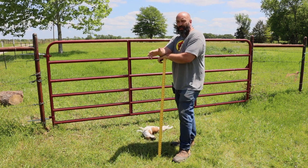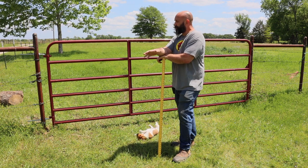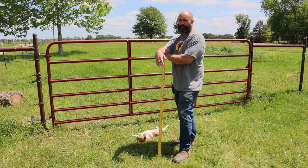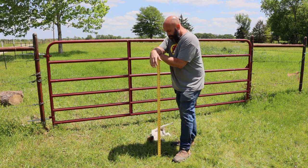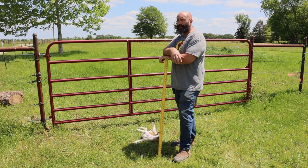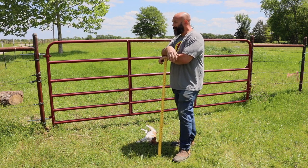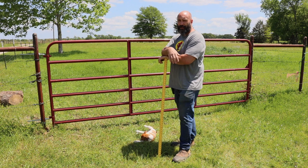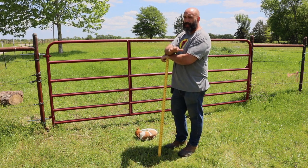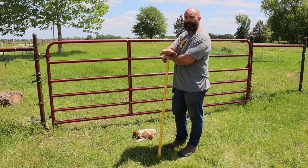One last thing, get yourself some 5/8 bolts. I think that's a pretty common size with these J-bolts for the fence hinges. You're probably going to want to oversize it and go up to the 3/4 bit, but in our case, we didn't actually finish the 3/4 size all the way through. We got it just stopped shy of 3/4, just enough to get the 5/8 in.